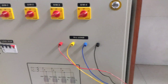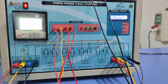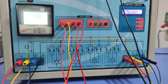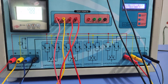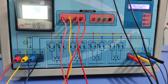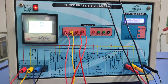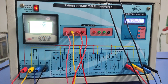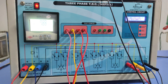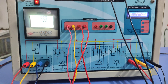The application of the TSC is to make the power factor unity. In real life, there are some RL loads, and due to these RL loads, your line current is lagging with respect to your line voltage, so the power factor is not unity. We need to make voltage and current in phase — that is the basic purpose. We will demonstrate the TSC operation in the next video.